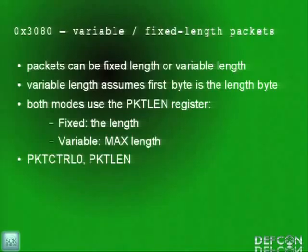So some systems are set up using what's called variable packet length. Variable packet length indicates, according to the TI radio anyway, the first byte that's received after the sync word is a length byte. And then from thereafter, that is the length of that packet. It's very good for dynamic data and not blowing a whole bunch of bits that aren't necessary with padding. It can be kind of arbitrary and not necessarily supported by every radio, but it's a good option to have.